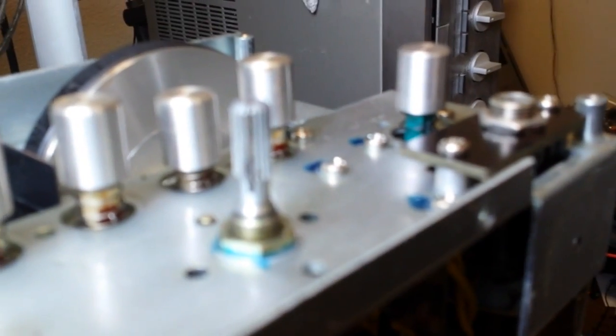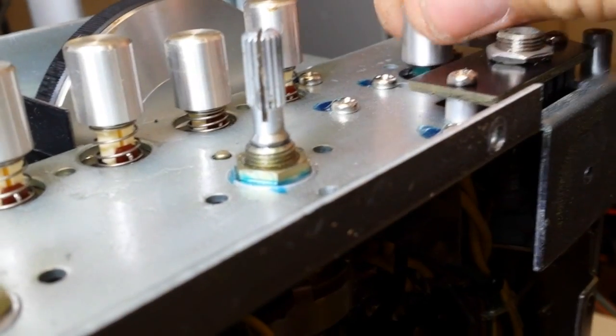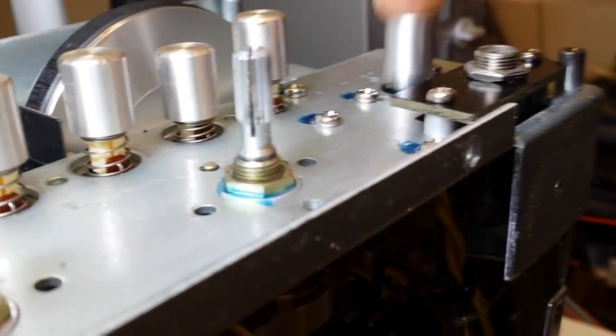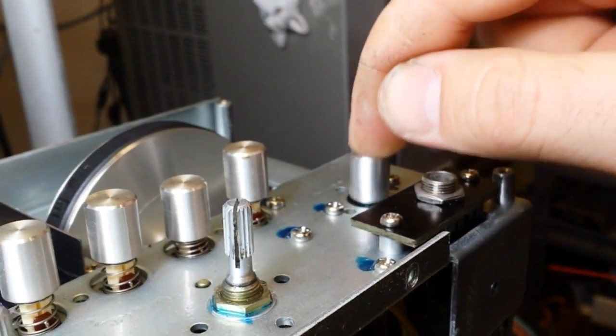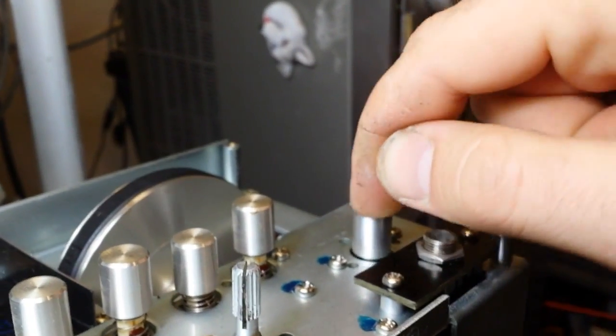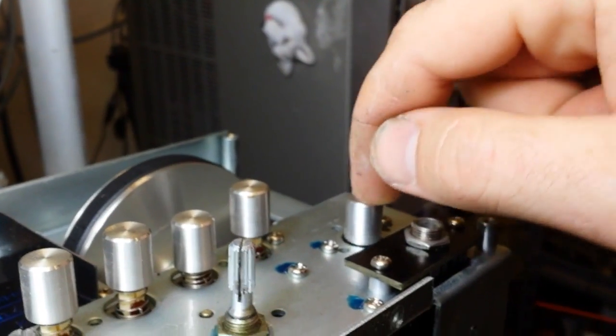If you've got a power switch that's got a blue shaft, that's made by Matsushita. Get a little bit of Deox-It in there, but wait a good 20 minutes or so before you turn it on. The Deox-It will wash out the gunk — the grease inside of there. The reason why you don't turn it on for a while is to give it time to evaporate, because if you leave the Deox-It in there, it will burn from the arcing caused when the contacts close, and it will actually worsen the condition of the switch. Those switches often times fail and they are replaceable.